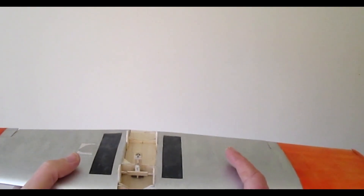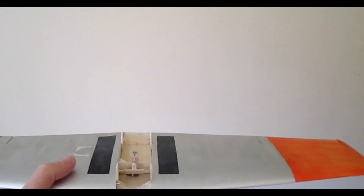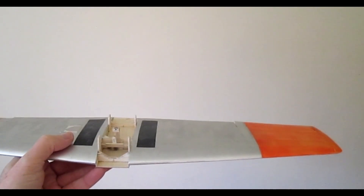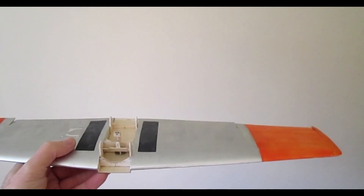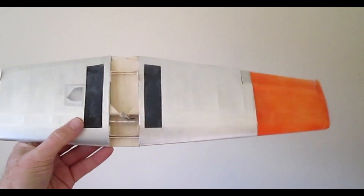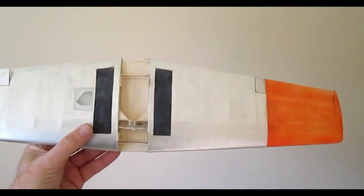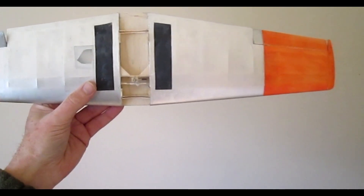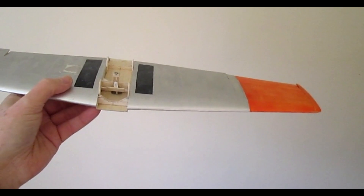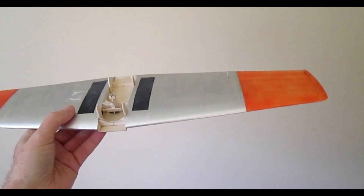This is where the ailerons are ground adjustable. The swinging arms can be slid in and out of this hanger here. Whether the image is in focus or not, you'll get a good idea of the sensitivity of the system and the freedom of movement. Perhaps this is a better way to look at the response in a steep climb or dive. Ultimately the pendulum will just give up. The pendulum bob weight is 0.8 of a gram, and the whole system weighs 1.4 grams, excluding the ailerons themselves.